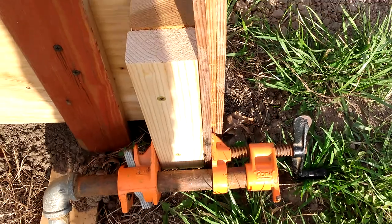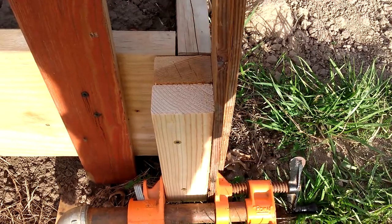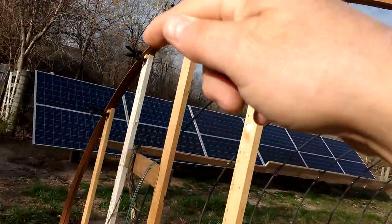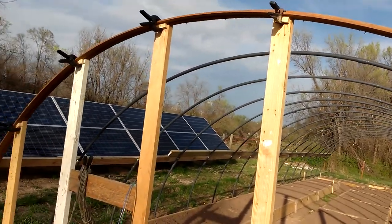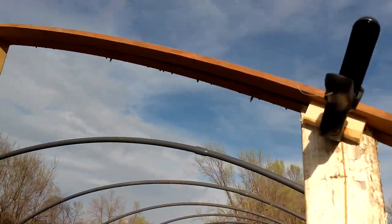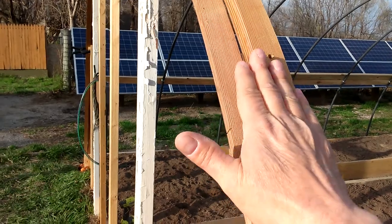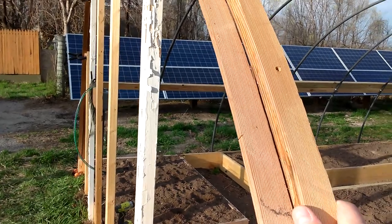Do it again with the third piece of wood, using a lot of glue between layers. Get a handful of clamps and get to know them — you'll need them to hold things in place. Use pipe clamps on the ends because there's a lot of stress there. You want to get this glued really nicely into the starter board — that's a one-by-three by nine-and-a-quarter inches. Put in the third laminate and screw it into the first and second all the way around while the glue sets, then leave it overnight. When you come back, pull all the screws out — the glue will hold them for the rest of their lives. You'll have built yourself an incredibly stable wooden arch, giving you a surface to sandwich plastic between laminates.